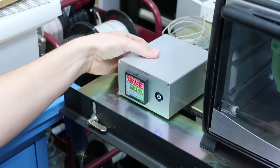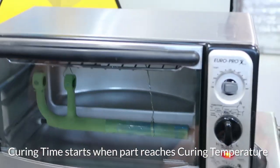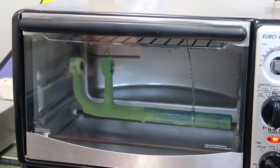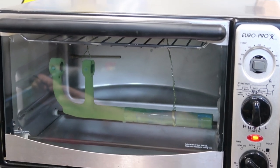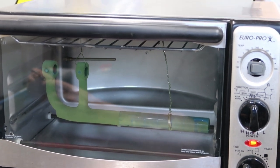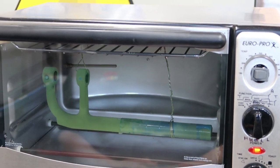The oven is currently almost at 300 degrees Fahrenheit and the part is getting pretty warm — it's a pretty fast process. This little oven is from a local appliance store, and we've altered it with a PID controller to solve the temperature swing problem most ovens have — swinging 50 degrees higher and lower. We've got it so it stays within a degree or two at all times, for a much more accurate baking process.